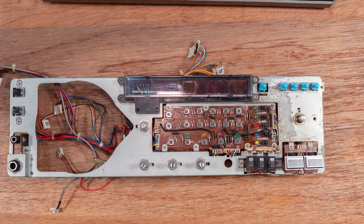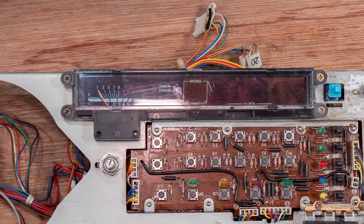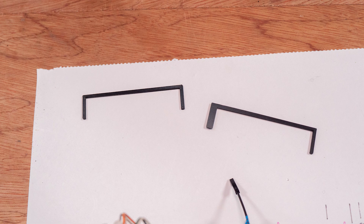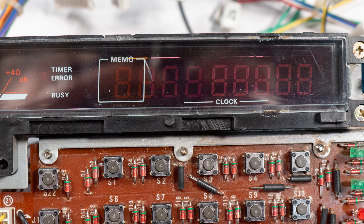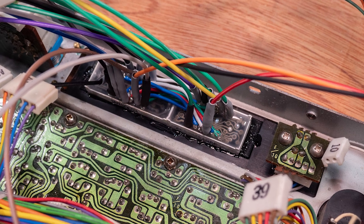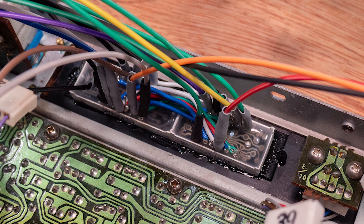I followed up with heat shrink to prevent shorts, then tested the whole assembly again and labeled all connections — black and green for the two sets of cathodes, and a different color wire for each segment lead. I left the female Dupont ends ready to connect to the display PCB shown in part two. To fit the new display into the sub-panel, I first loosened and cleaned the transparent assembly with isopropyl alcohol, then made a 3D-printed bracket to hold the two LED blocks together and space them correctly in the window.